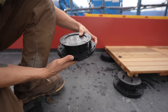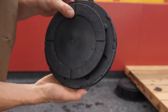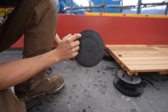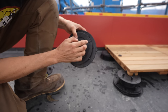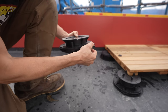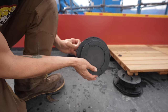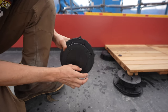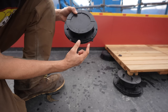My slope is one quarter inch per foot. There are two tabs on the pedestal you can adjust really easily — when the tabs are all the way apart, that's flat, zero. When the tabs are all the way together, that is half an inch of slope. Since my roof is only a quarter inch of slope per foot, I only need this tab about halfway — so tabs 90 degrees apart, which is halfway. I'm going to line up the downhill slope right in between these two tabs, and that'll make it slope perfectly towards the rooftop drain.